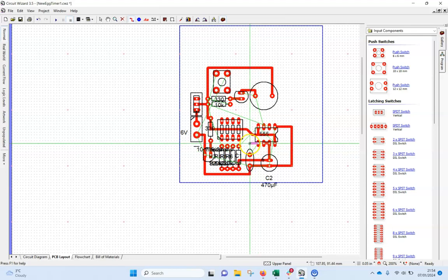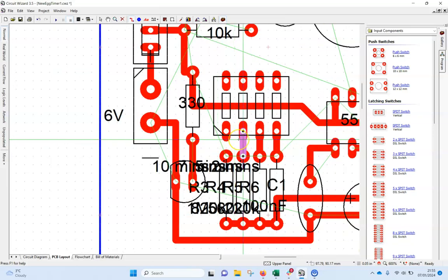The other end of this capacitor here is meant to connect to there, so that's nice and neat — just bring that across. Now where do the other ends of these resistors go? They just connect straight down. Left click, left click, right click off — bring these across. Obviously these give us different resistance values, which affects the capacitance and gives us different timings.